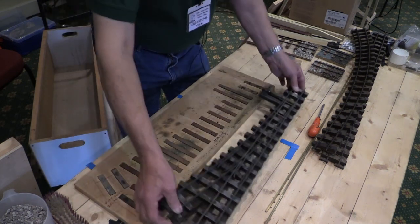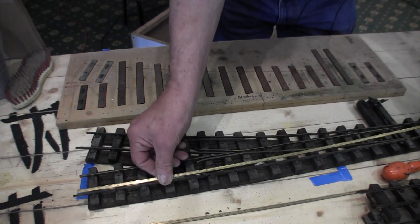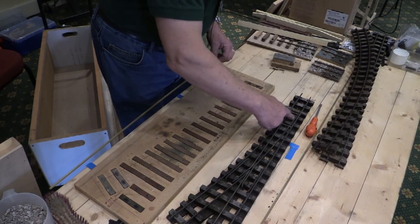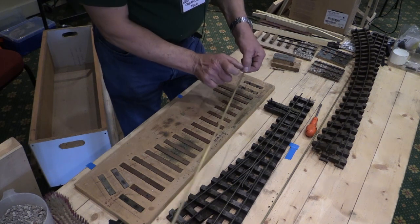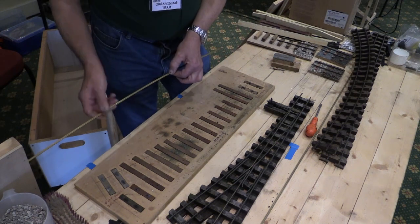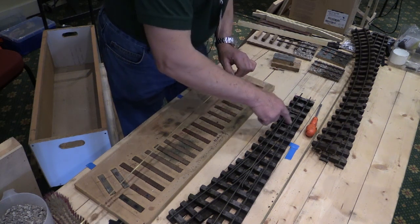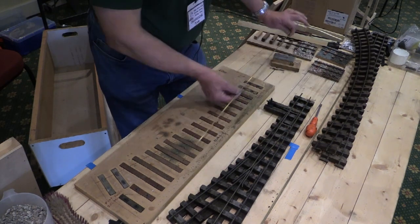Once you've got those in, and again this is where the preparation is letting me down slightly, you cut the straight rail the correct length for there, and where the taper rail meets, you file. I have a large flat file, put this into the clamp on vice, and gently file the side of the rail down until you've got the step in for the blade to go into. That's the only filing required on that one. You can then slide that in.